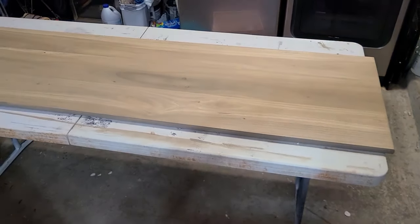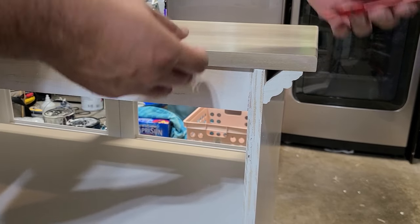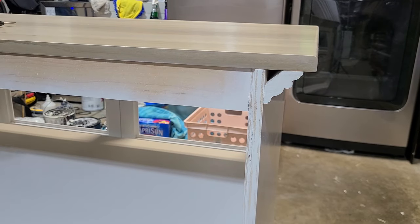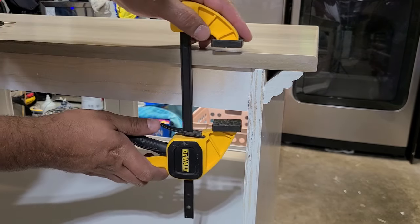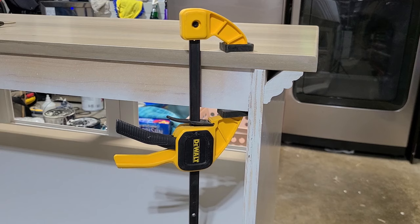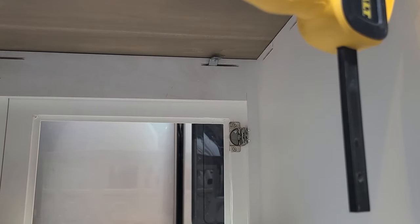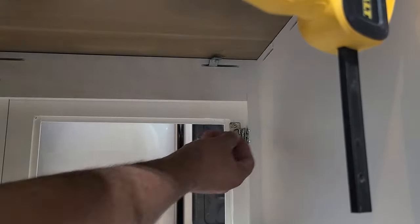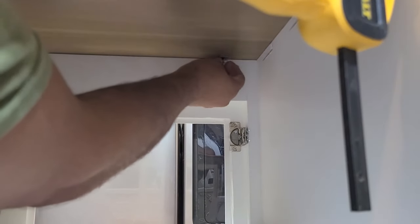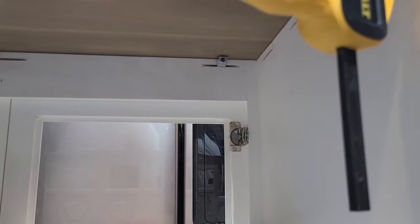After I did the onlays I set up my little paint booth in the garage and sprayed a couple coats on the credenza. My wife stained and clear coated the top. Here I am aligning the top to the molding so it's even left and right and flush on the back, then attaching it — I've been using a wooden biscuit joiner to cut slots and attaching the top to the cabinet using z-fasteners, which allows for the natural wood movement of the top.